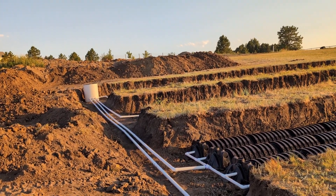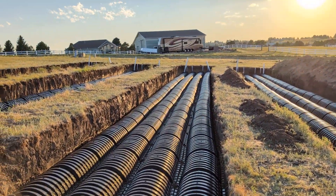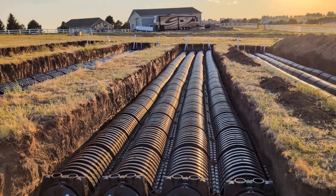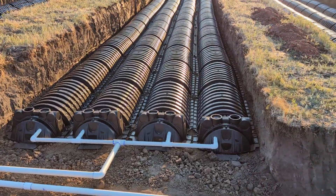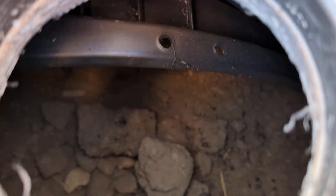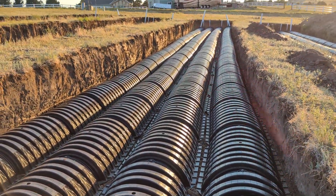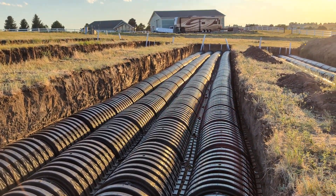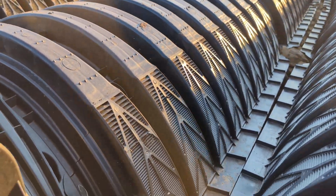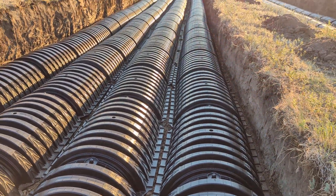All four beds are identical. On the far end there are large-diameter four-inch SDR-35 drain pipes — those are inspection pipes. There's a hole drilled in the end cap, making it an inspection port where you can look down and see the dirt. This system didn't require gravel or sand — we just had to scarify the local soil and the chambers take care of the rest. The chambers are designed so dirt can't fall in the sides, but they have louvers cut in to allow micro-leaching, so moisture bleeds out sideways and downward.